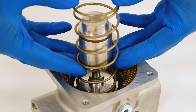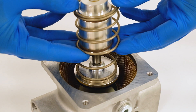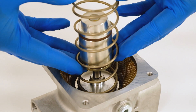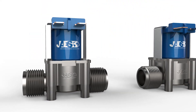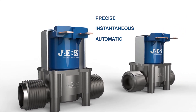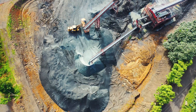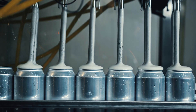When the solenoid coil is energized, the whole plunger, rod, and disk group moves upwards, overcoming the force of the spring and the pressure of the fluid. Compared to manually actuated valves, solenoid valves have the advantage of being extremely precise, instantaneously operated, and they work automatically. In fact, they are used in all possible applications in order to make operations more efficient in all aspects.